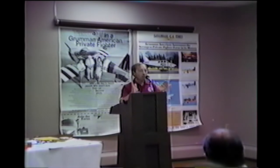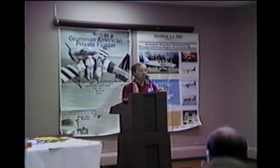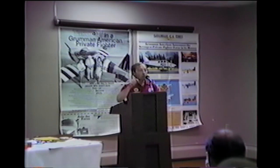If you got a spar leak, we were taught a long time ago by Bruce Fortune from the factory, who spent a week with us sealing about 18 airplanes. The first thing you do is you just jerk the wing off, flip it upside down on a sawhorse, pull the access cover so you can get in there and work on it, scrape the old sealant out. You put in a combination of two sealants, PR-1422, I think is the standard tank sealant, and then you put on the one the manual doesn't tell you to use, which is PR-1435, which is a brush sealant. You can fuel over that. You got to let the first one cure for a significant amount of hours. You also use PR-1435 to seal your access panels back with.